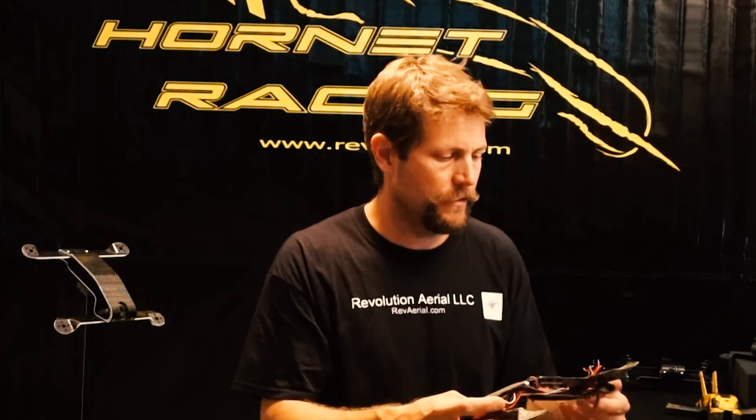You can still see that it's a little bit too squishy. So I go back to the drawing board and make these two frames a lot thicker. One of the problems with this is that if you try and make this in a long piece, you can't get it off the mold because of its shape. On the back the fit and finish is really terrible because as the vacuum is put on the part, this extra material has to go somewhere. So this was a successful design, but because of fit and finish, I had to split it into a top section and a lower section. This machine went well, and I ended up dismantling it to put all the pieces into a Hornet 2B.